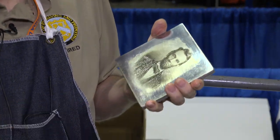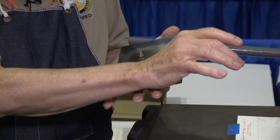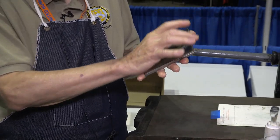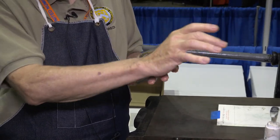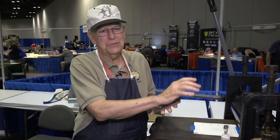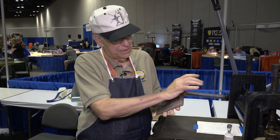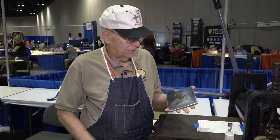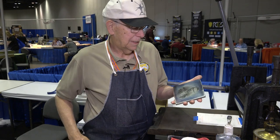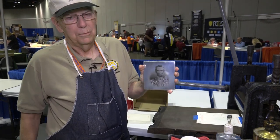Our next step is called hand polishing. It's just a little chalk in my hand to keep my hand dry. I'm actually gonna hand polish the surface to take all that additional ink residue off there without bearing down too hard — we don't want to take any ink out of the engraved lines. Okay, that looks pretty close.